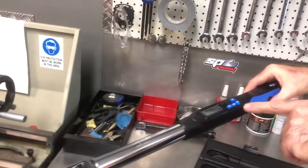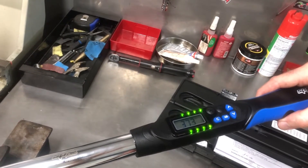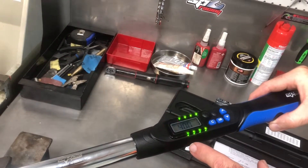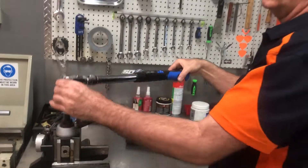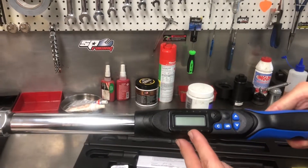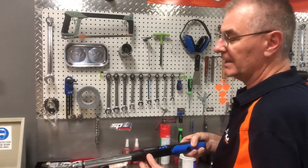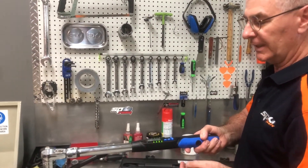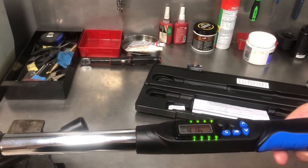As we pull up on torque you can see the torque measurement increasing. When we get within 10%, the green lights illuminate and start to flash. When I get to the exact torque I want, the red light comes on — as soon as you see that, you let the torque go. The unit remembers your peak torque. In fact, I've gone a tiny bit over to 41.6 newton meters instead of 40. The green lights give you a warning with an audible sound, and the red light tells you you've reached your target.